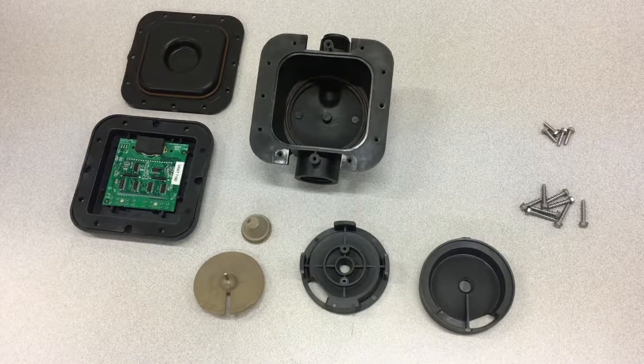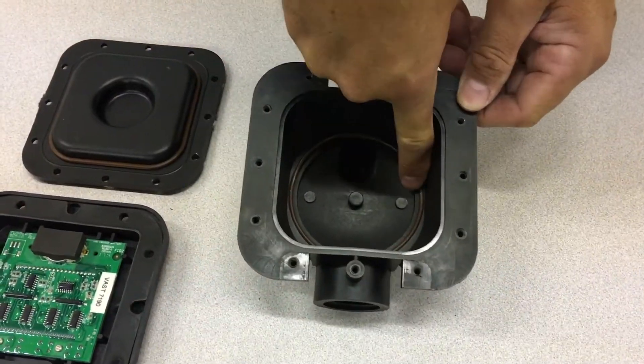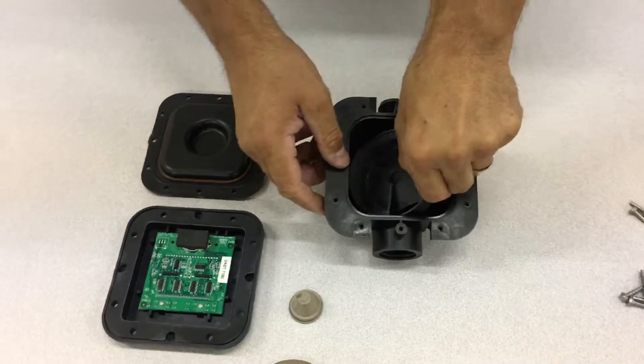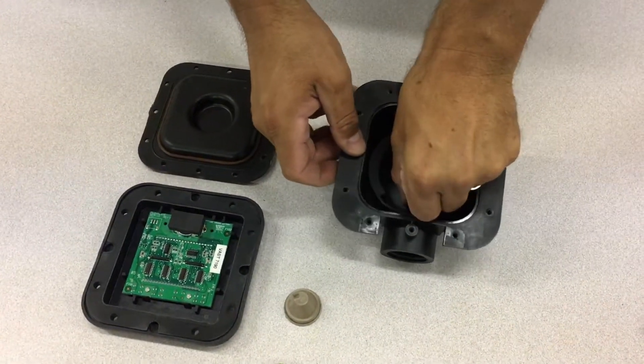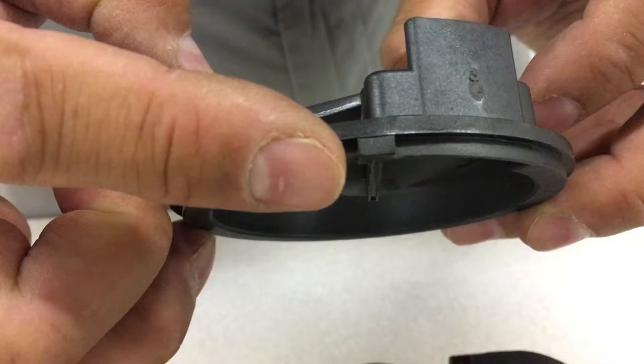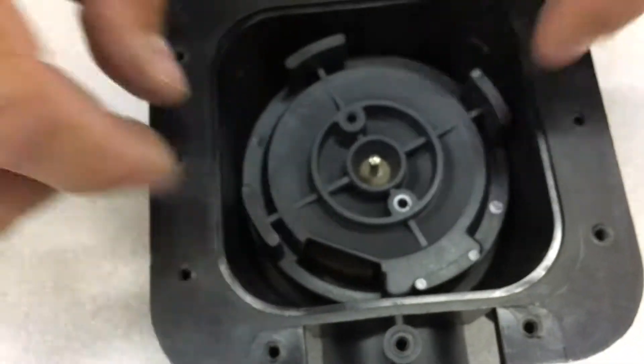After switching out the parts you need to replace, start reassembling the chamber kit. Make sure the correct gasket is on the bottom of the housing. The bottom part is the black plate without an open hole in the middle — place the brown disc inside of that. Find the notch on the black cover of the chamber kit and rotate it into the groove on the face.